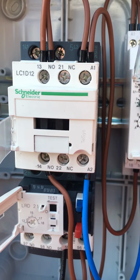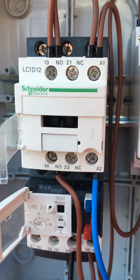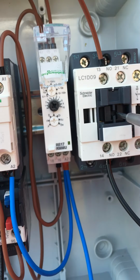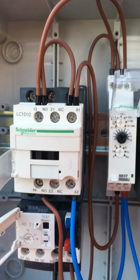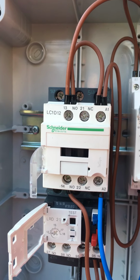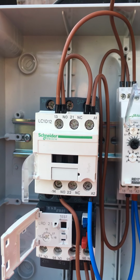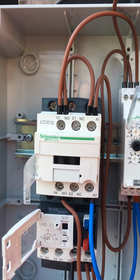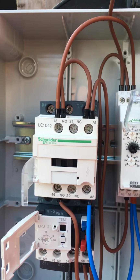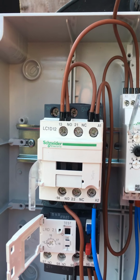You go, well, that's the same as a delay on timer. Now it's energised because there was a countdown of the timer. So what this will stop is, if I'm doing this, you'll only do it once when the timer's elapsed. Bang, you did it then. And I can do this all day. So this is a 3 minute timer. You do this every 3 minutes for once. The compressor would just come on one time and off again.